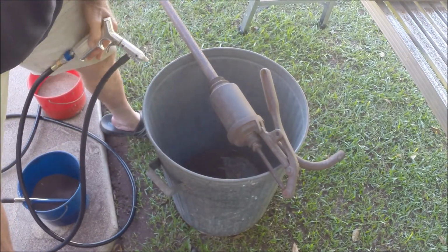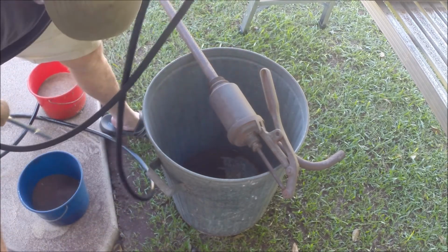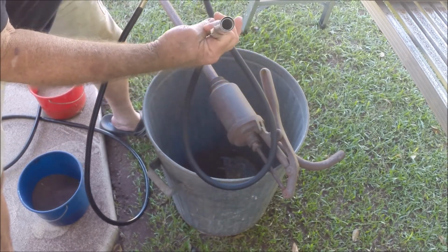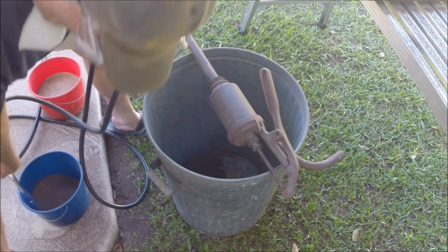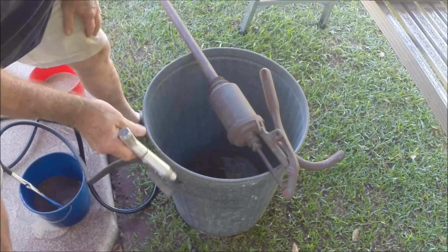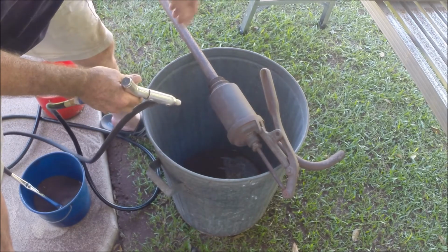What turned out to be a bit of a nuisance too is that when you've got the grit bucket, this nozzle that goes into the bucket keeps on moving, and that's where you get the intermittent flow. It's got nothing to do with the hose in this case. The feeder tube keeps moving, and then eventually sucks in there, and you get no grit.